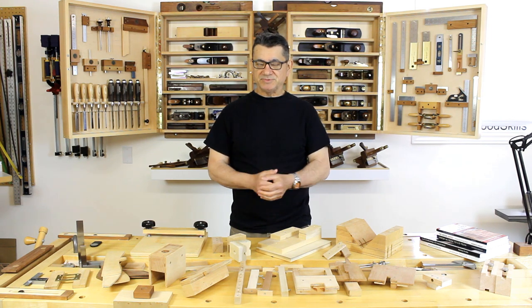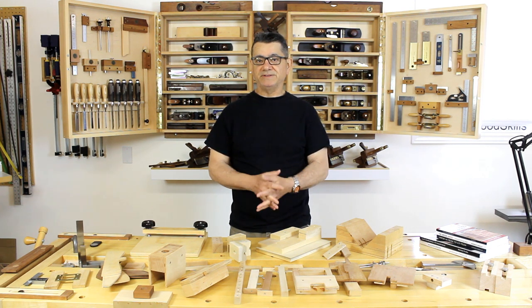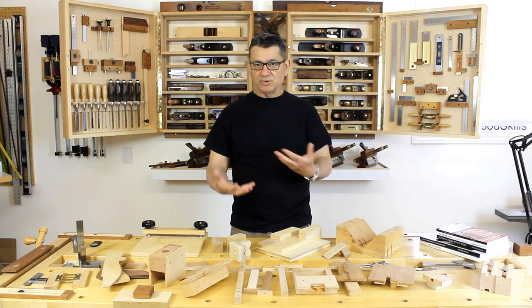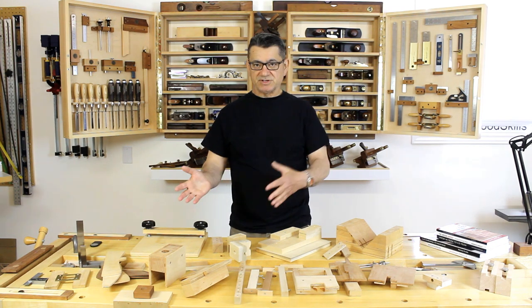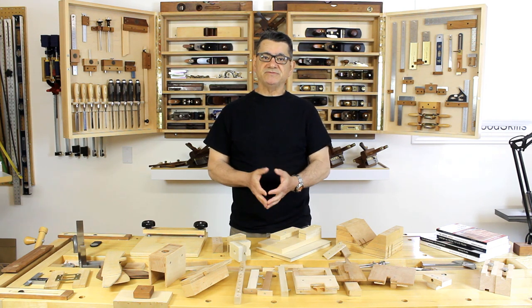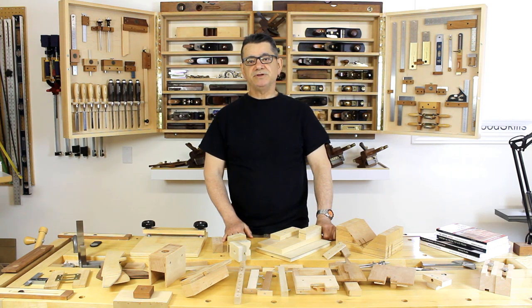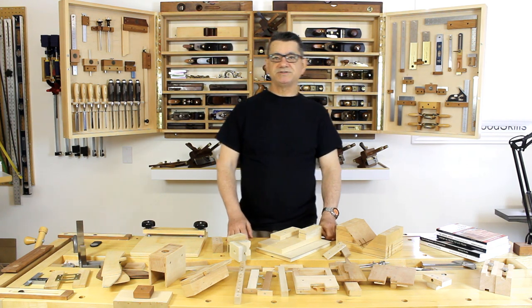In industrial terms, a jig is a work holding device used to guide the motion of another tool, like a cutting tool or a drill bit. Jigs are heavily used in industry, in metalworking industries and for creating components for machine work. This has also migrated down to woodworking over the years, of course, or decades. The main purpose of jigs is to increase interchangeability, to simplify your manufacturing process, and to assure high accuracy and repeatability in the mass production process.